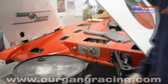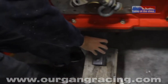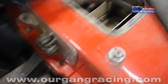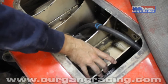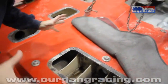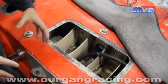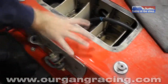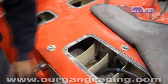Moving back along the other side, we've got the strut, which is basically a bearing for the prop shaft. We have a water line that cools the bearing in the strut, and we have a lot of structure in here to keep the back of the boat together. This is where the majority of the twist in the boat occurs, so you build lots of aluminum structure to tie everything together and basically box it. You can see there's some stress cracks here and here. Even with all this structure you're still going to have problems with twist, but the Red Dot's holding together pretty good.